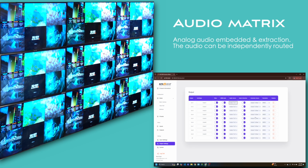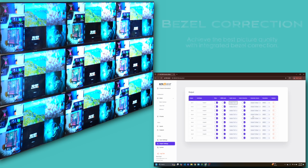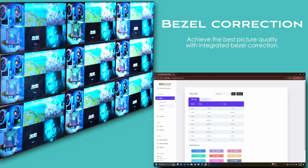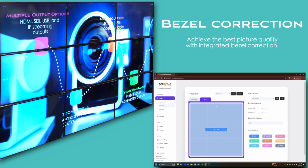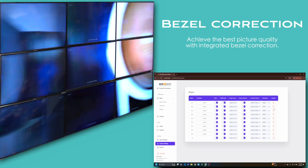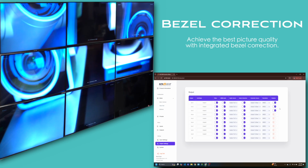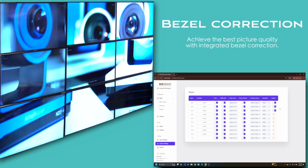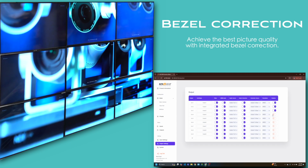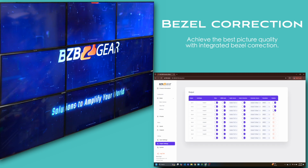So we get a lot of questions about, hey, I set up my video wall and the TVs are flipped for the thinner bezel. We got you covered. There's a rotation button. So I'm going to go back to our video wall here, just flip that over, or switch it over. And then if I want to rotate the top TVs, just hit this rotate button. They're upside down, but if your TVs were obviously flipped upside down, it would flip it back over. So we have the option on every output, you can rotate it 180 degrees to compensate for that TV that's flipped over.